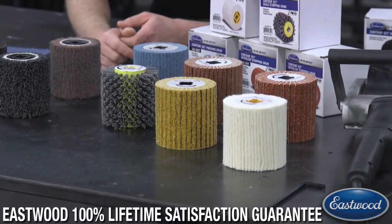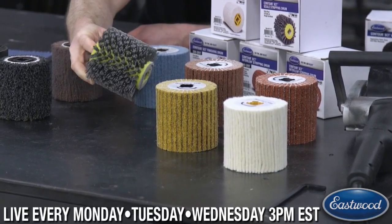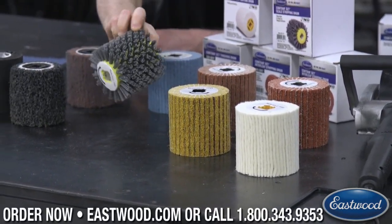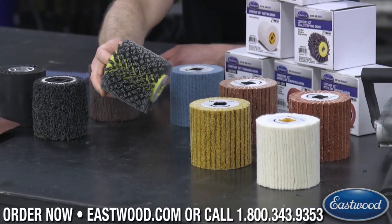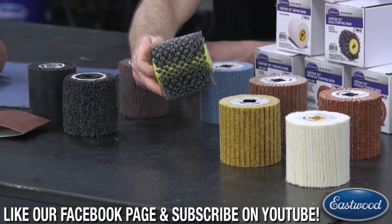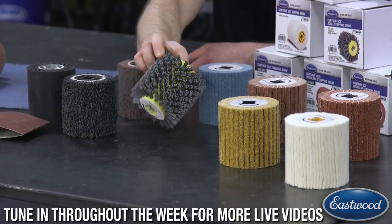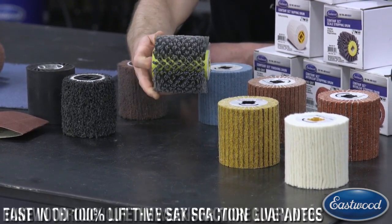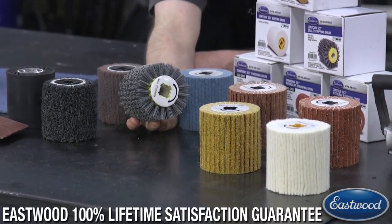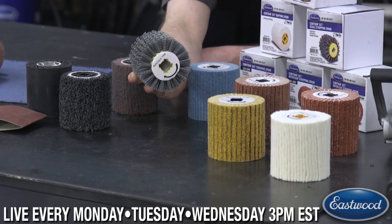Because they're so popular, we tried to offer some other variations and grit sizes. We listen to you when you leave us comments on social media or send us emails. One of the biggest things we heard was that some drums — like the black abrasive and the red one — if you hit a sharp edge with them, or you're trying to work around something that's not just a smooth contour, it eats them up quick, it nicks them. It's just like when you use a cutoff grinder — if you nick it, it's done. So we've got this one that looks almost like a wire-brush type configuration. That thing is aggressive enough to take paint off, but you can work around edges, sharp areas, or even hardware like rivets or bolts in a frame without destroying it.